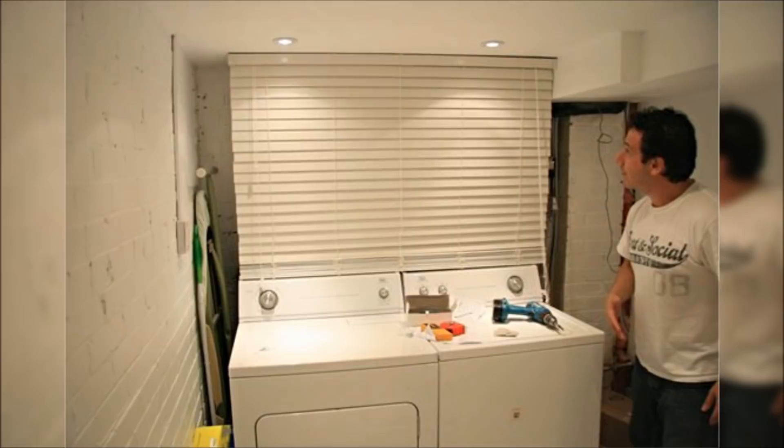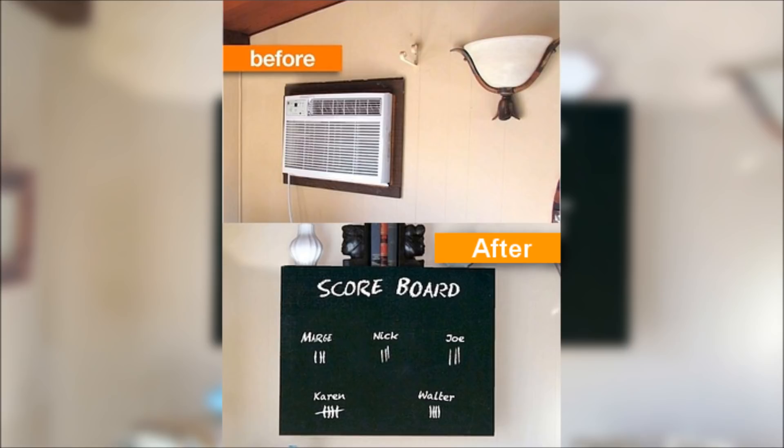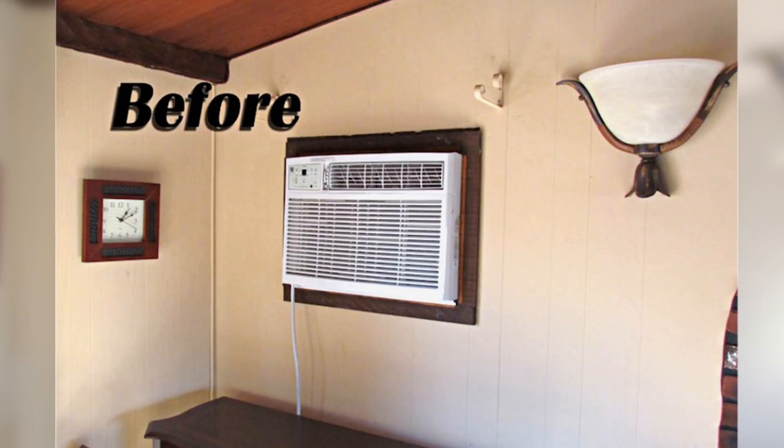5. Cover up an AC unit with a chalkboard cover. You'll have to build a wooden frame, but if you have any carpentry skills whatsoever, it's oh so worth it. Step 1: My AC unit has a frame molding around it. This frame will be how the box or cover will be attached to the wall. I measured the top and bottom and added 3/4 by 2 to the measurement. Step 2: Drill 3 holes on the ends of the top and bottom pieces with the countersink. Lay out top, sides, and bottom piece and fasten with wood screws and a screwdriver.